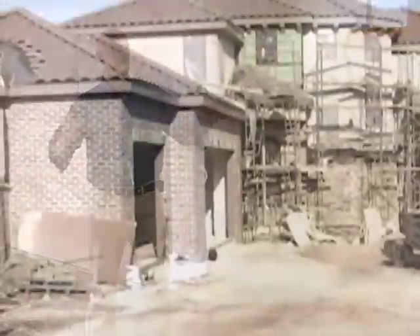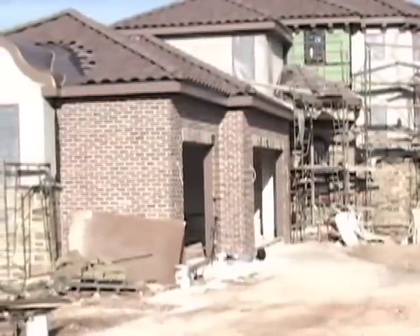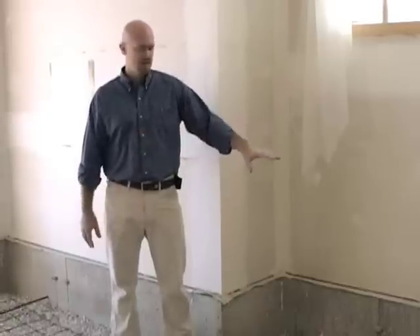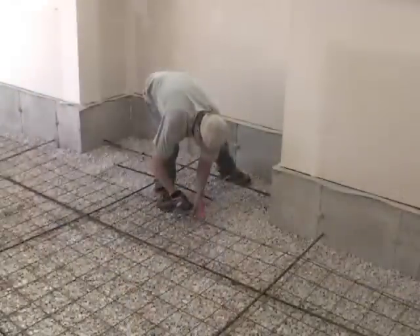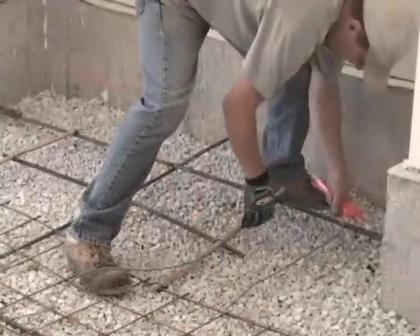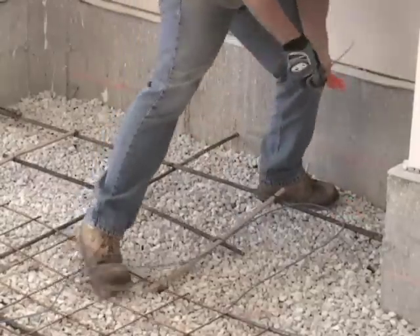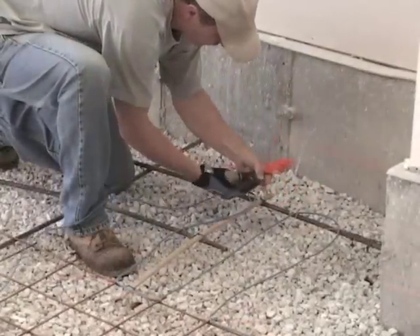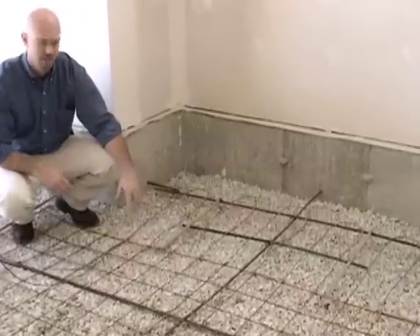In this project we're doing the garage. One of the nice features is this bump-out where the lights are able to come in and give a little more depth to the room. We want to make sure we cover the floor in this area as well, because we're not sure what's going to go in here after construction — it could be a workbench or any number of things. We'll make sure we get the floor evenly heated in this area just in case. As you can see, we've come in and woven the cable back and forth to cover this area, keeping it in line with the rest of the floor to allow the next run of wire back to be evenly spaced.